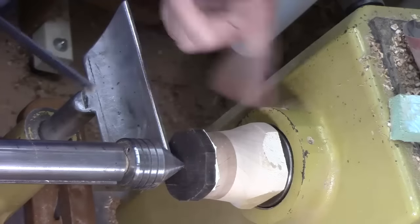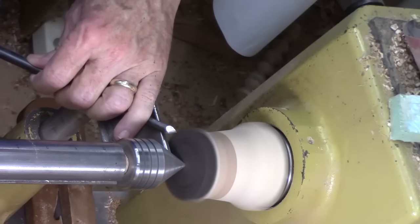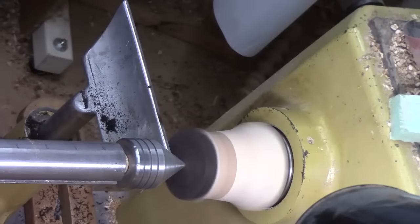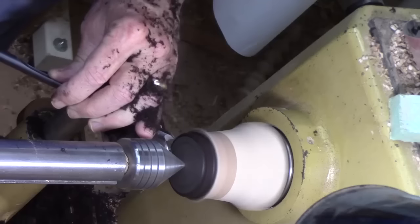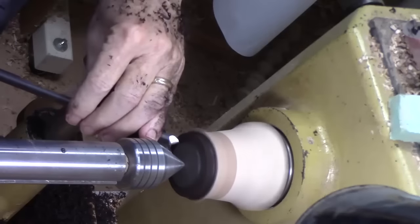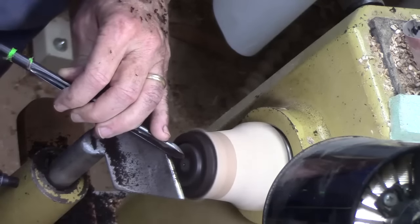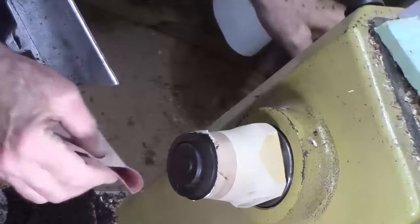Now I'm going to turn this round, then shape the bottom, and then we'll reverse it — I'll show you an interesting trick for that a little bit later. Using a 3/8-inch spindle gouge. Let me tell you, this African blackwood is very dense and it will shine up just really nice. We're going to sand that up just a touch before we put the big grooves in — start with a little 180.